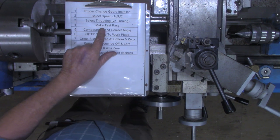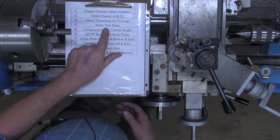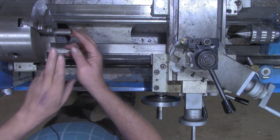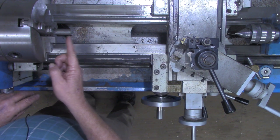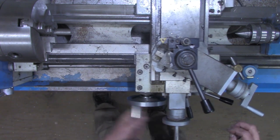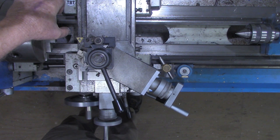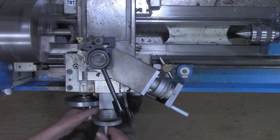And chances are you will have it done ahead of time, but I probably should put a step in there saying prep your workpiece. Now, you can do some workpiece prepping after the change gear is installed as long as it doesn't involve turning. Remember, we're stepping much faster spacing in between each revolution than we would be if we had the regular feed gears in. But what I need to do with this is face it, put a little chamfer on this end down here for the thread to lead in, and cut some thread relief. So let's face this off first.